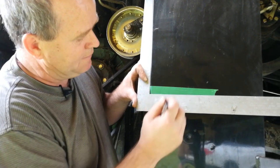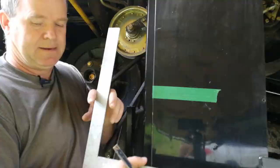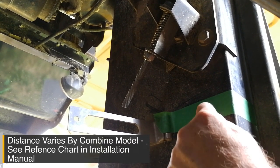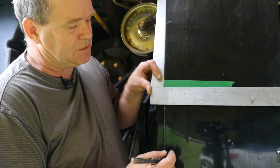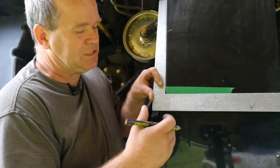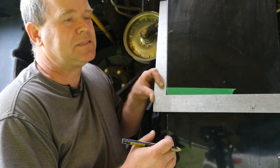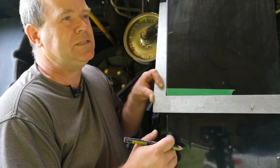We mark 1.75 inches on our tape on both the inside and the outside. The inside mark will be 1.75 inches in from the back, same height as on the front. Certain harvesters, due to the geometry of the chain itself, we have to cheat slightly to the back of the center line — this would be specifically the TR series that we're aware of. So if we have a measurement supplied in the table, please use that.